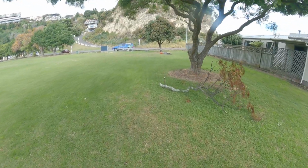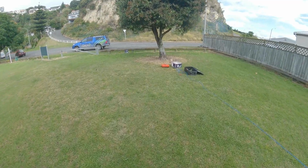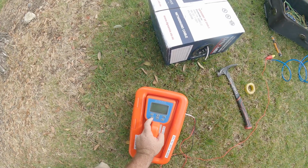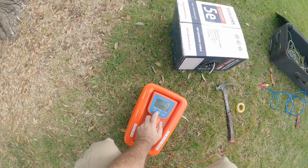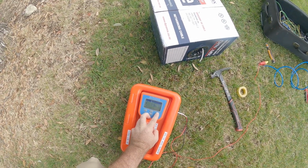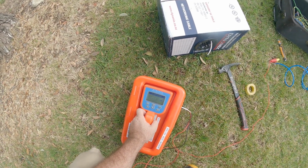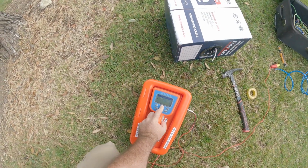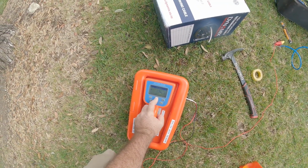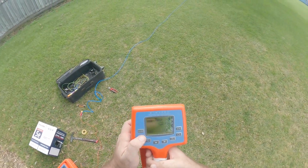So we'll do one more at 61 kilohertz. Automatic wants to do 1%. Let's give it some juice. 21%, still 0 milliamps. Interesting. 40%, 3 milliamps. Let's go 50%, 4 milliamps to start with. Frequency 61 kilohertz.